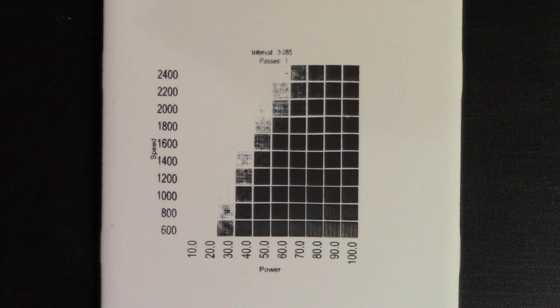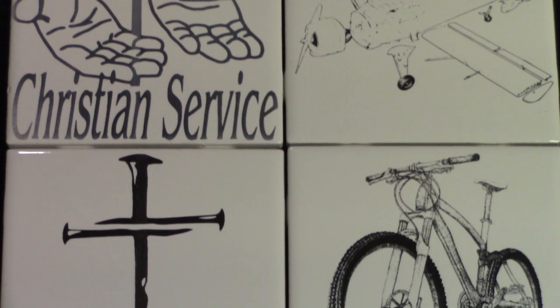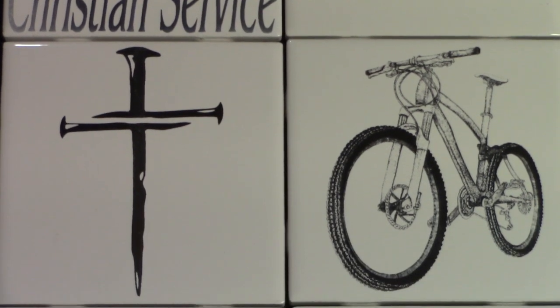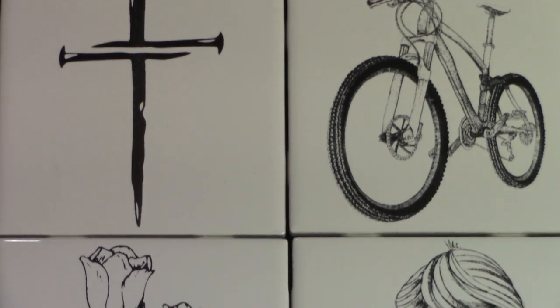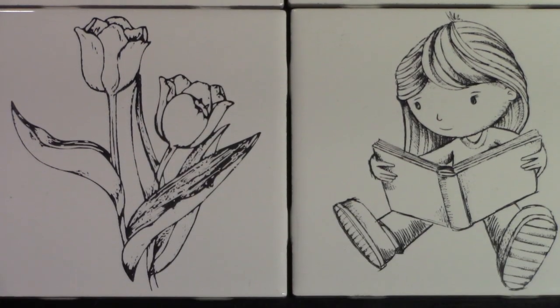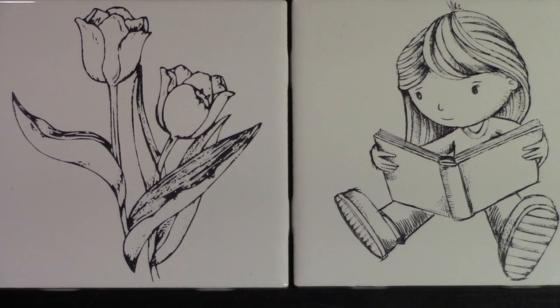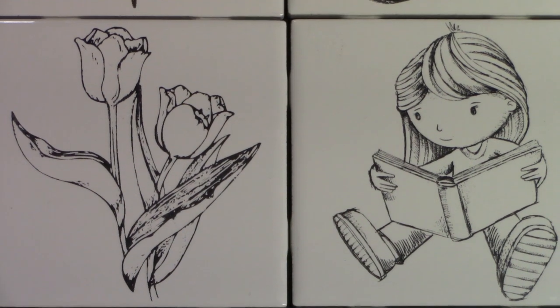The reason that this worked was I took this tile and cured it. I put it in between some fins of a heater and let it sit for a few hours. That seemed to be the trick — I was painting too soon. Once I figured that out, the burns turned out pretty well. Several people have commented that they've been able to spray the cold galvanizing compound on the tiles and burn pretty much right away without issue, but I found letting them cure worked out well. 24 hours is about the time it needs to set up.